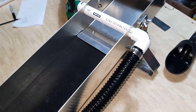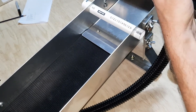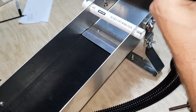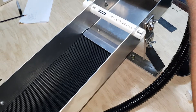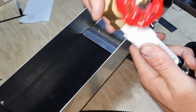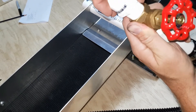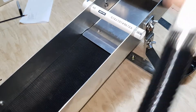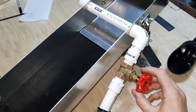If you want to get a little bit more advanced and really control your flow, remove that fitting and fit to a 20mm bung, followed by a control relief valve, then another 20mm bung and your water source. So we now have complete control over our flow through our gate.